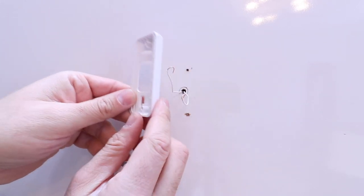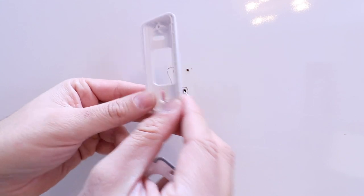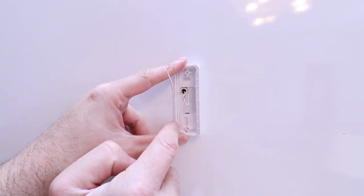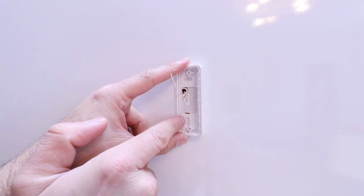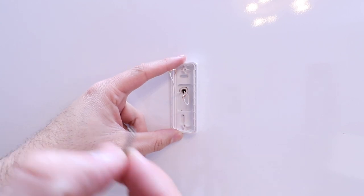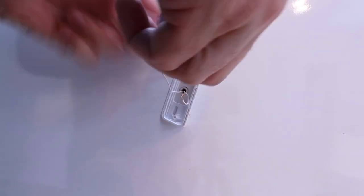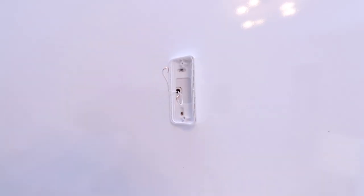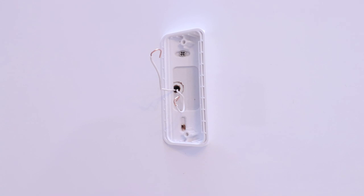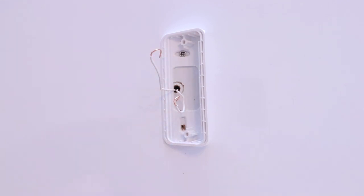To install the mounting plate, choose whichever direction you want it to face. We're going to put two screws into the mounting plate — there's a screw hole up top and one at the bottom. Use the longer screws provided in the bag. We'll use the existing hole to make it a bit simpler. We've got our top screw installed and then take the bottom screw and install it into the slot. There are two slots that allow you to make slight adjustments to the doorbell while it's installed.